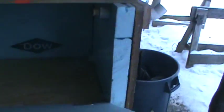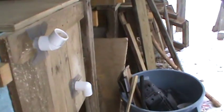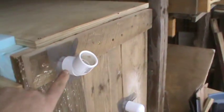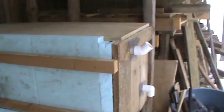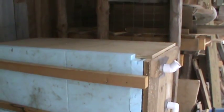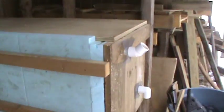Here's the box I built — it's gonna be my battery box. I got some two inch foam styrofoam in there on the bottom and all the way around. That little pipe in there is where the wires are gonna go into the garage. I got some venting pipes — just some PVC I had laying around — one coming up, one going out. Put a little screen so bugs and wasps don't fly in there and make a nest. I was reading about batteries: yeah, when it gets cold they're gonna lose power and amp hours, but they also say on a fully charged battery they don't freeze. So that's what I'm gonna do. Maybe down the road I'll buy a couple sealed batteries, but for now this is what I'm gonna do.